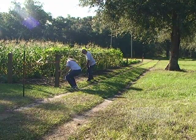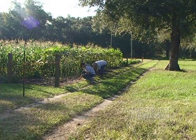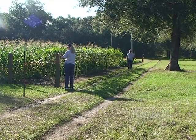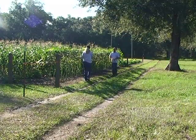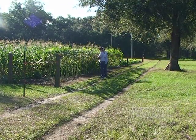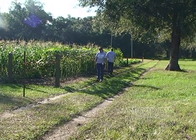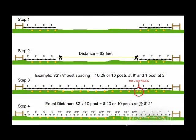At this point, we're actually measuring for our posts, making painted marks on the ground. Here we've elected to use 10-foot post spacing and using steel T posts. There's a term in fencing called checking in. That will allow you to get equal post spacing from corner post to corner post. Checking in is an important part of the project for proper post spacing. For equal spacing throughout your project, measure the last hundred feet and divide equally to best match your desired spacing.